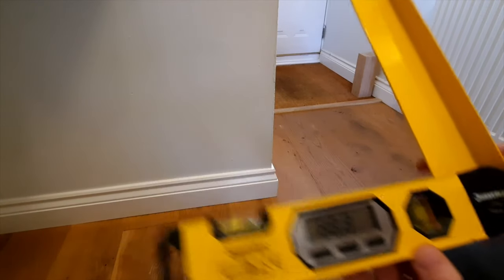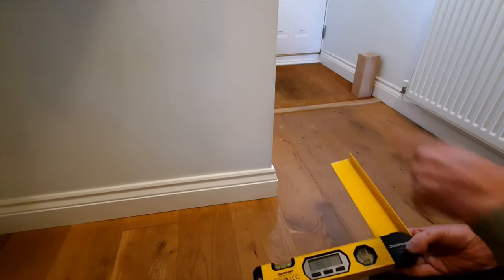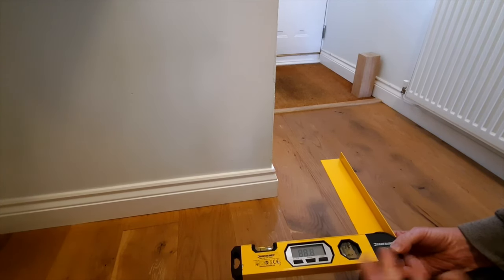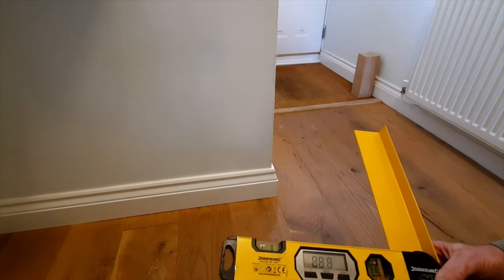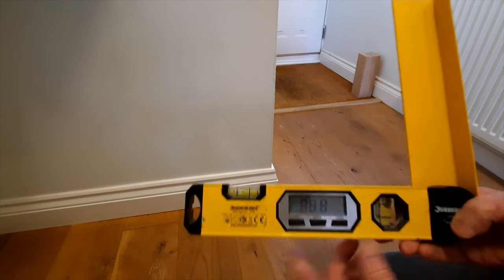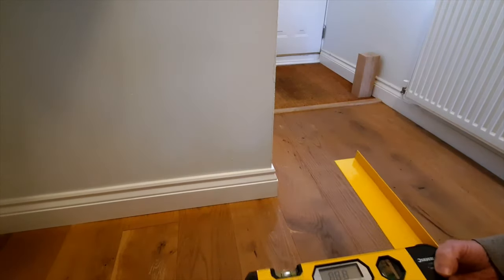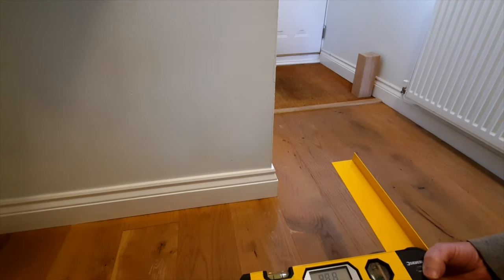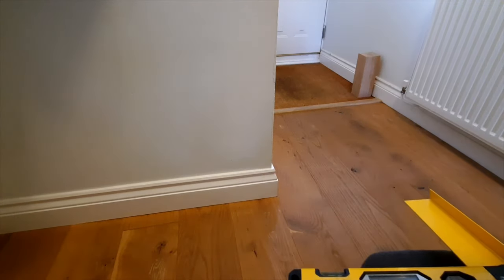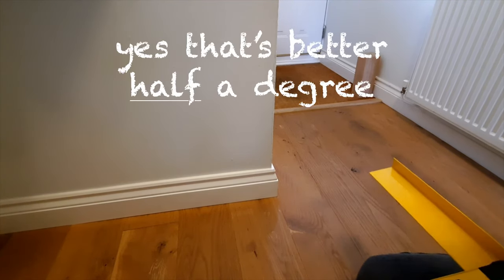What I've got shown is 88.8 degrees. Normally you'd expect two sides to come together at 90 degrees, and you'd cut skirting or baseboard at 45 degrees. But you'd find a gap because the angle isn't right — the half of 88.8 is 44.4, not 45 degrees. Even just half a degree sticks out like a sore thumb at the joint.